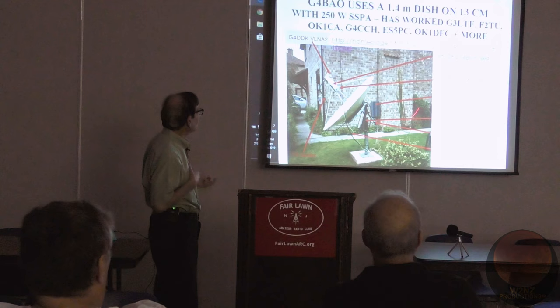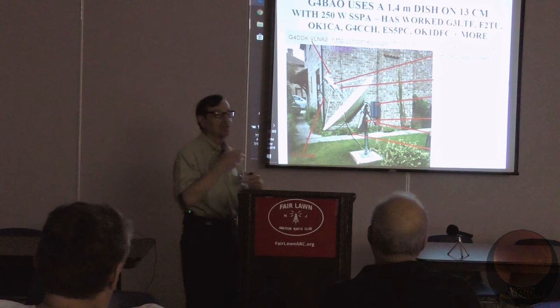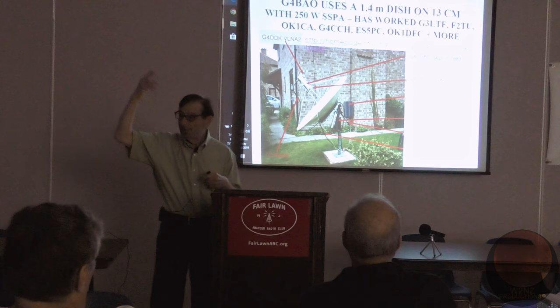This is just another example. This is a fellow who is regularly active. I just talked to him a couple weeks ago on 3400. If you look at your microwave ham bands, I'm sure that's not dripping off everyone's lips over here. You all know 144 and probably 432 and maybe 1296, but above that you've got 2300, which is 13 centimeters, then 9 centimeters, then 6 centimeters, and 3 centimeters, each getting smaller and smaller.